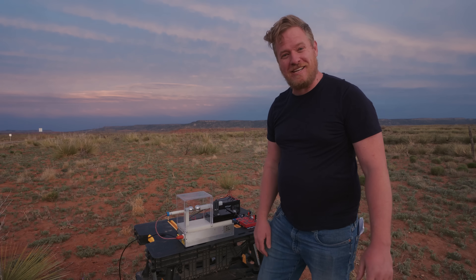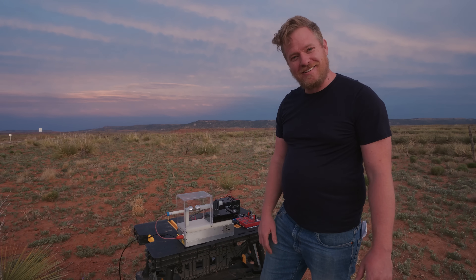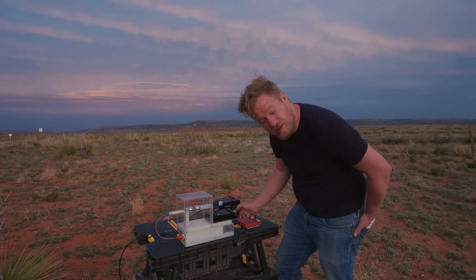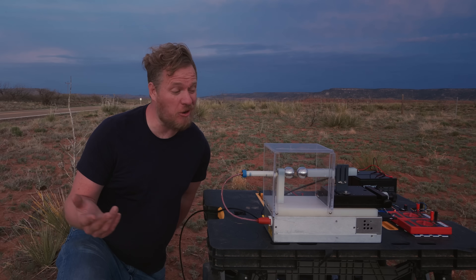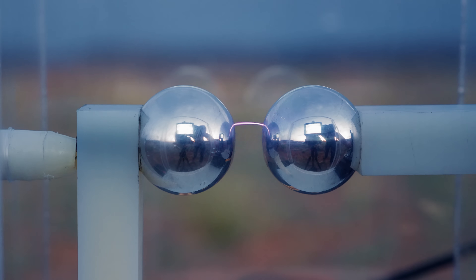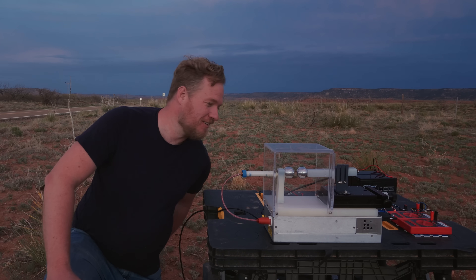Now let's drive down to a lower elevation and it should get shorter. I'm now at 4,000 feet, just a little ways from the town of Tucumcari, New Mexico — which, believe it or not, is about as low as I can get in a day's drive from my shop. The arc distance here is 9.2 millimeters. So coming down to 4,000 feet, it's already down to 9.2 millimeters — more than a two-millimeter drop. That's pretty substantial. And if we went all the way down to sea level, it would be even more. From 4,000 feet to 9,400 feet, there was a 28% increase in the distance an arc could jump. So even if you build a pretty healthy safety margin into your design, you can see how altitude could eat into that pretty quick.